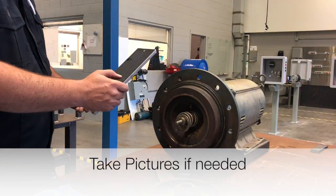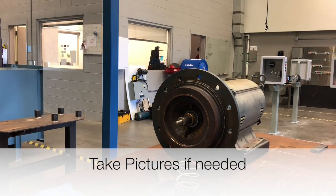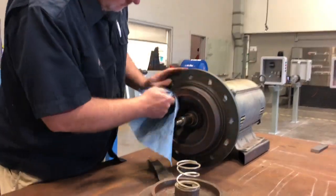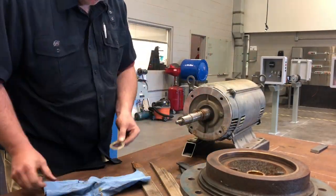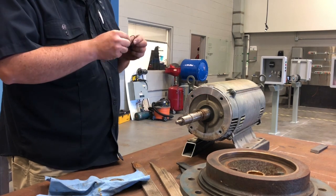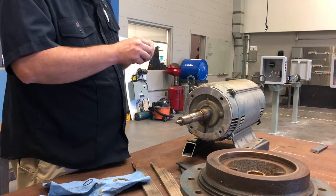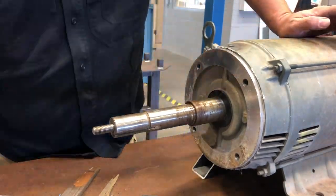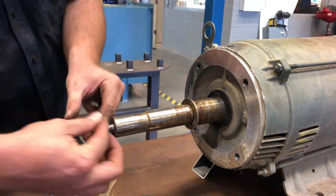Once you get the impeller off, you're just going to need to pull the spring and some of the shim washers out of there. Make sure that you remember which way they went, you know, shim then spring. Could get confusing when you go back together. Next, you just go ahead and slide off the frame and some of the other sealing washers and O-rings. At this point, it is a good time to check that dust cover, which is what he just pulled off. Make sure it's nice and clean, not torn, before he puts it back on. Maybe put a little bit of white grease on it. That way everything slides together nice.